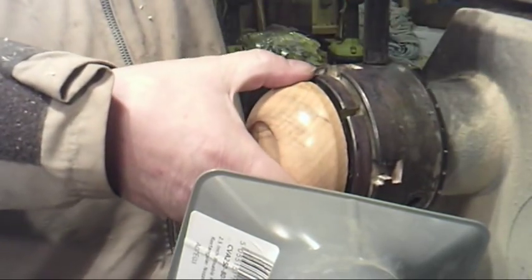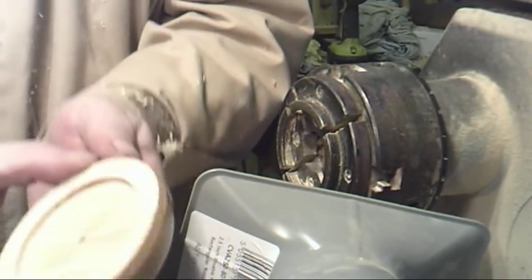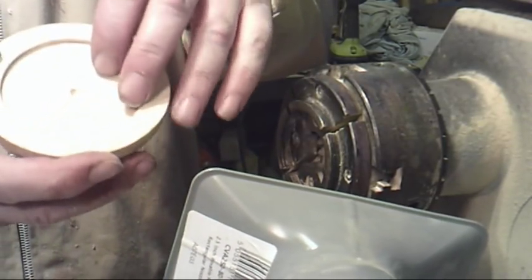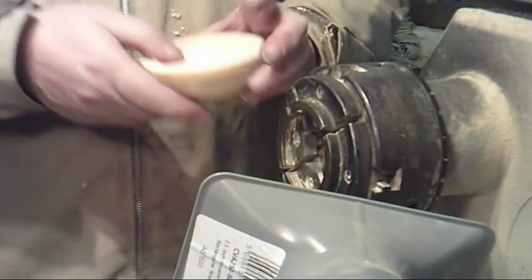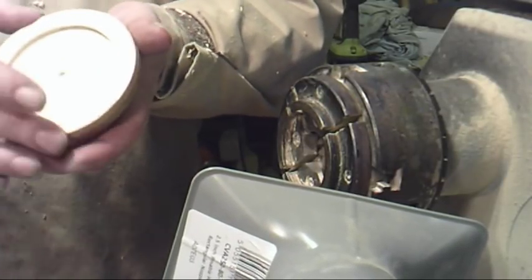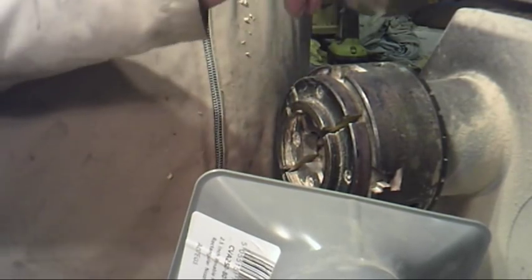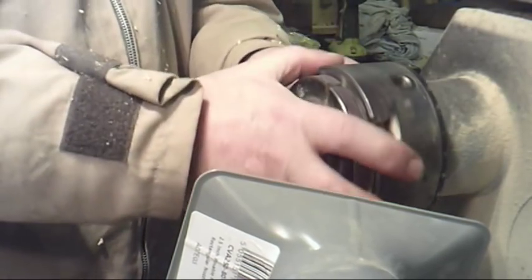That's the bottom done. Now again, what I've done on this piece of ash, don't know if you can see, I've drilled a hole in the top. That's a 67mm hole. I want a 67mm forstner bit, and that actually fits straight onto the jaws. Great for platters, great for little things like this where I'm not wanting to really go too deep. I don't really want to use a screw chuck. A faceplate ring won't really fit on there and would probably spoil it. So that's ideal.